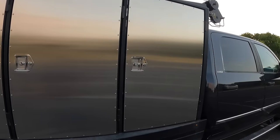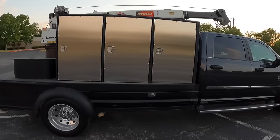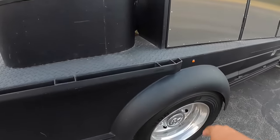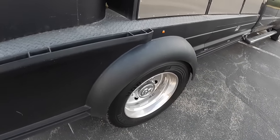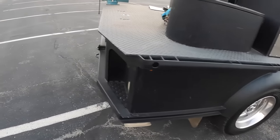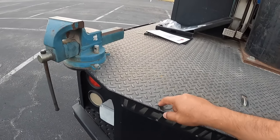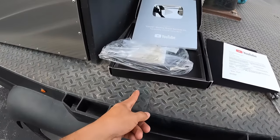Not that hard to build — if you're a decent fabricator you can build it. It just looks fancier because of the stainless. A lot of folks go with elbows like these — these are 10-inch 90-degree elbows that were welded together with the arch cut out for the wheel. It looks really thick but it is not — it's an angle iron facing outwards. It's got a 3/16 top here up until this point, then it's 10 gauge.